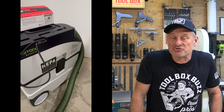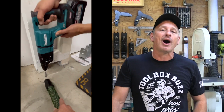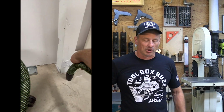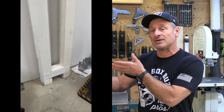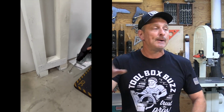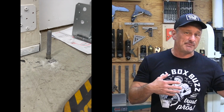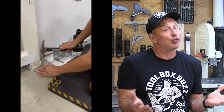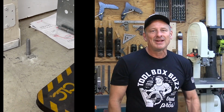Now, as a remodeling contractor, when I think of job site vacuuming, my mind goes to one of three options in my tool arsenal. Dust extracting, which is connecting to a tool or collecting dust at the source. HEPA vacuum, used to clean a home or an area after we've made repairs, clean carpets, stairways, finished flooring. It's our best vacuum typically and not used for demo debris. And wet dry shop vac, used for heavy debris, messy, nasty demo, wet vacuuming, and general vacuuming.